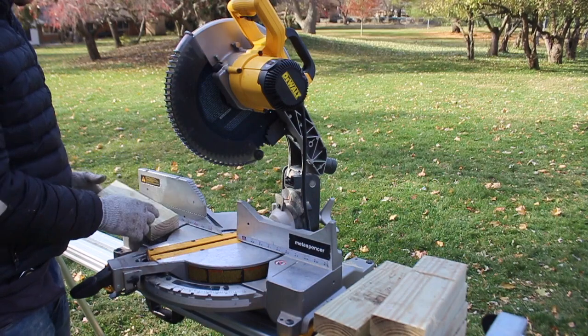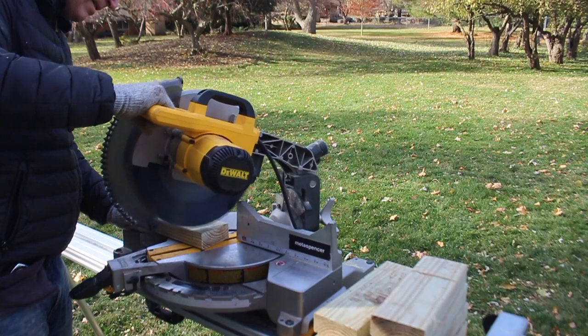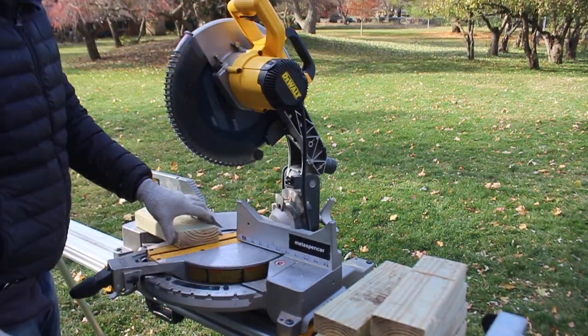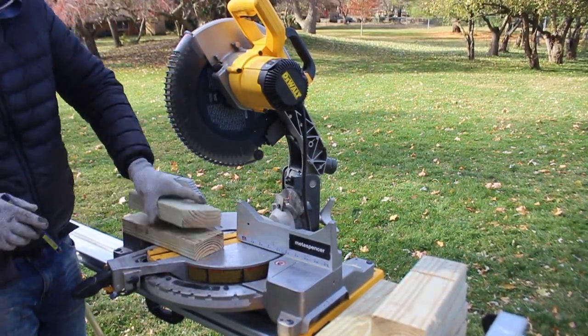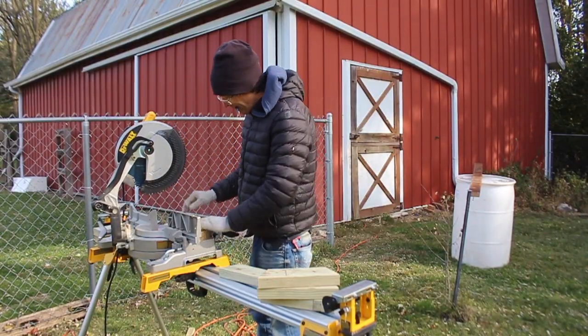It's just predetermined. Whoever figured out that octagons are made up of twenty-two-and-a-half-degree angles — I love that. It's like it was Pythagoras and his crew or something. Anyway, you cut a bunch of these guys really precisely — again, ten-and-a-half inches long at the points, that way it will accommodate your barrel.